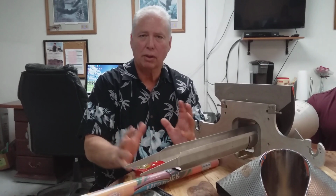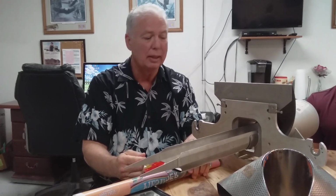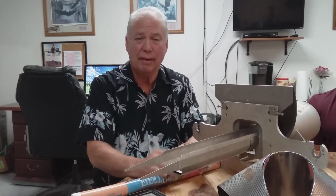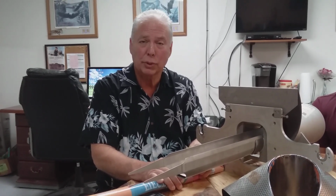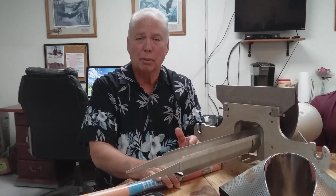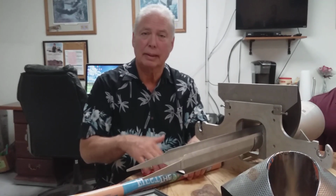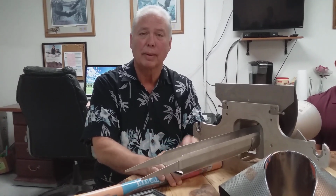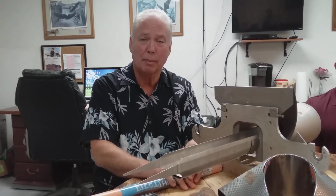All these things look like they're just static, but there are molecules whirring around, and these different surfaces have different personalities. Stainless steel has a very high surface energy, about 75 to 77 of what's called dynes. If you see our video about surface treatment or corona treatment, you'll know what that means. So the problem is trying to get this film that is sometimes not slippery, or doesn't have a low coefficient of friction, to slide over the stainless steel, which has high surface energy.